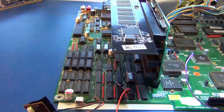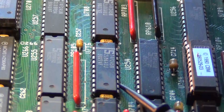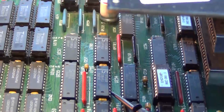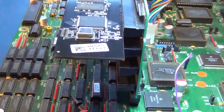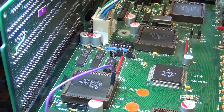I set up my scope to watch bit 21 out on the Zorro bus, which ends up being ED-5 — the easiest way for me to pick that up was at U716 pin 13. If you zoom in, you can see my clip attached to U716 pin 13. I also needed a trigger, so I decided to use the DOE signal on the Zorro bus — the easiest way for me to grab that was on Buster pin 21. Using that DOE signal I could have the oscilloscope trigger on it, making it easy to watch the analog value of that ED-5 pin on the Zorro bus when driving that bit high or low.